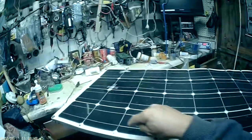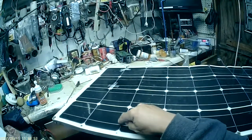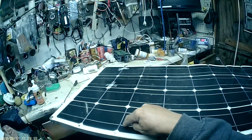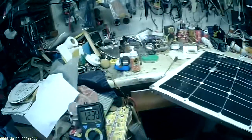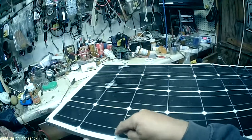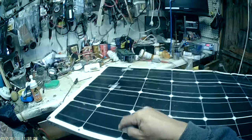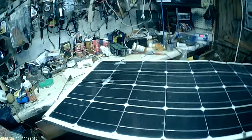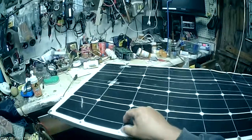Find a way to get through these little tabs with the soldering iron — dig it out, dig the plastic away. You'll see the silver tab. All you have to do is stick some solder flux on there, put a little ball of solder on it, get a wire, find a place to go through that's not hitting the cell, melt the hole through it, come through. You can go from this side to that side with a little strip of wire.